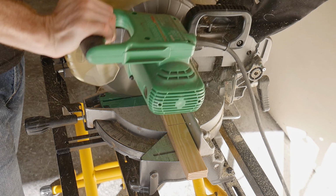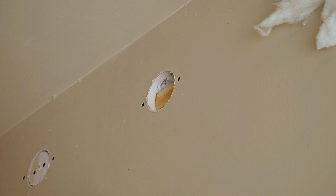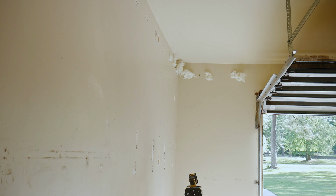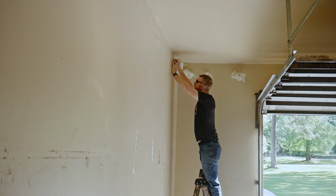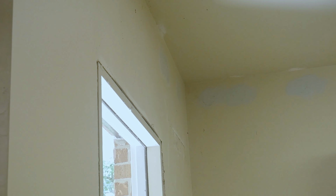To do that, I took little boards. I used these boards as a backer, and then took the pucks that were left behind by the hole drills and then just screwed the pucks into the backing board and filled the hole. And then you have a little ring around that you fill up with some spackling. And after that, I got the place painted.